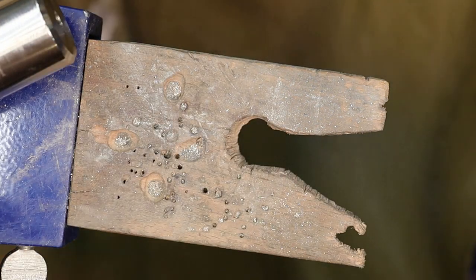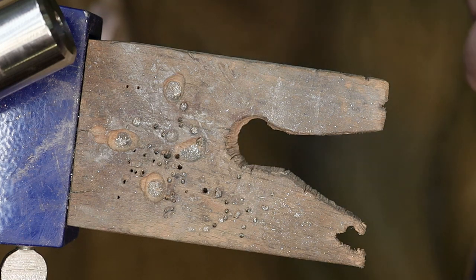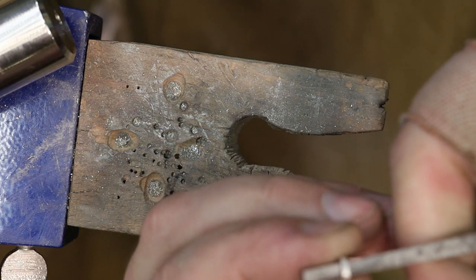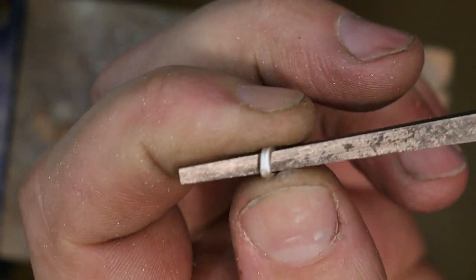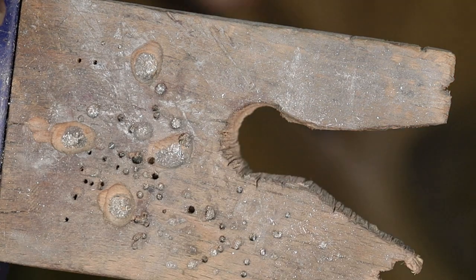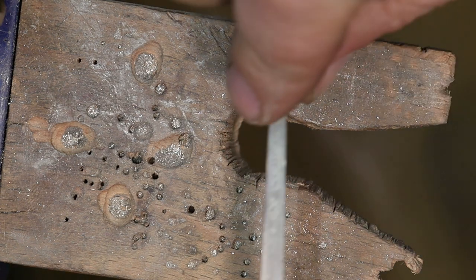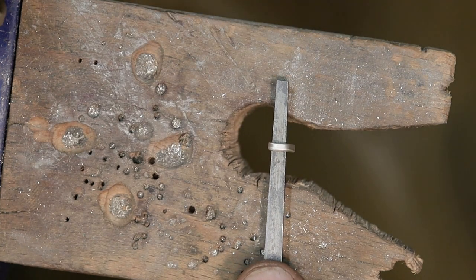And then I'm going to cut off some of the excess, because it's not going to wrap around, it's just going to go on top of the band soldered in place. So now I have that guy. Zoom, there we go. And I have kind of a U-shape. That U-shape is going to be rounded on the corners, because when metal like this forms around a mandrel, it pops up in the center and causes it to kind of bow. Now you can hammer it back in place, but you're still gonna have some rounding occur. Let me find where my rawhide go.